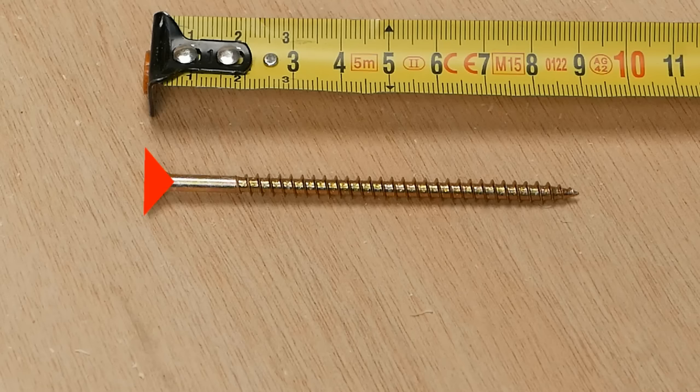One last thing: the head of these screws have a V shape, so if I tighten them too much they will work as a wedge and could split the wood. It would be better to use screws that are flat in that part — they wouldn't work as a wedge, so it would be more difficult to split the wood.